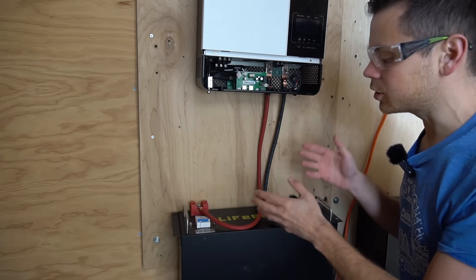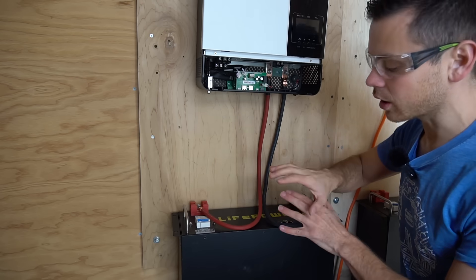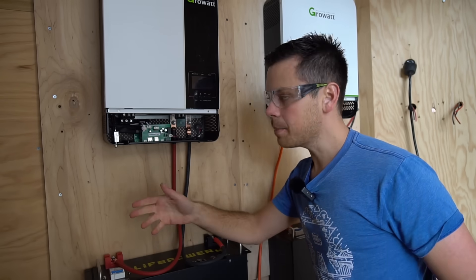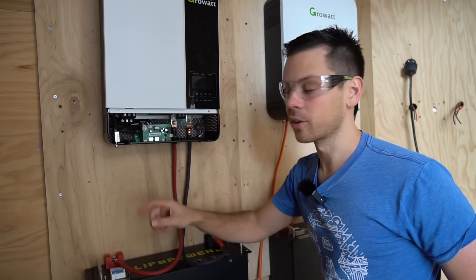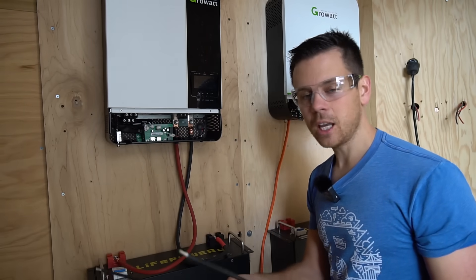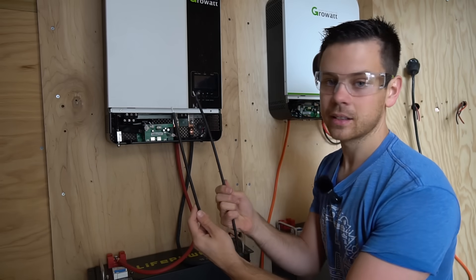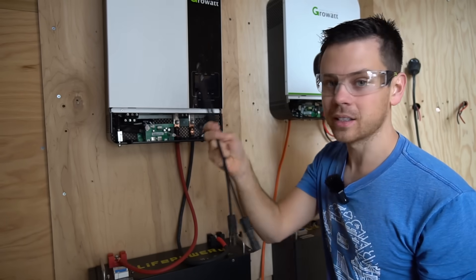Do not turn this breaker on because it could turn on this inverter and create a high voltage. Do not flip this breaker on until you are completely done building this system. The next step is connecting solar power to the solar input. We have positive on the left and negative on the right. Solar panels are the most dangerous part of this system because they cannot be turned off like the battery or the inverter. To keep this safe, I recommend taking an MC4 extension cable, cutting it in the middle, stripping the ends, and inserting these into the terminals and tightening them down. This way you can connect any solar array you wish with these adapters. The hardest part is knowing which to put in positive and which in negative.